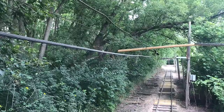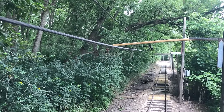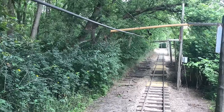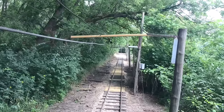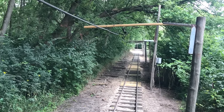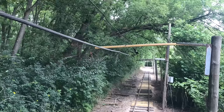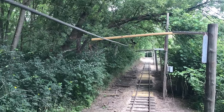Wire tension hardly ever needs adjustment once you have it set pretty well — it just stays there. Of course when a tree comes down and knocks the wire down it changes things. Through the seasons you'll notice that in summertime your catenary gets kind of sloppy and in wintertime it's pretty tight — that's just thermal expansion and contraction. There's a little bit of droop in the wire and that's normal.